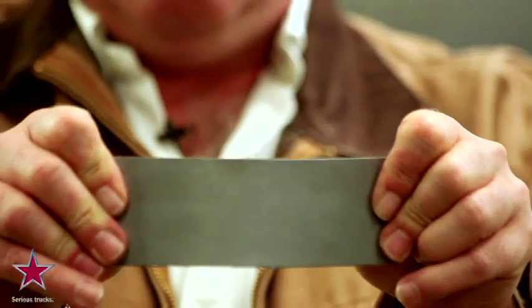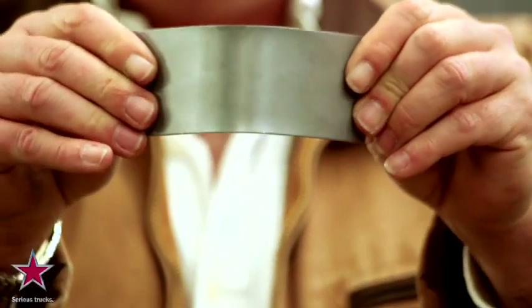With galvanizing, the steel is dipped in the 100% pure zinc, then it's attacked by air knives to get the excess off, and then it's baked at 1,000 degrees. What occurs at that baking or annealing process is that the layer of zinc actually bonds into the steel. So you have a coating of 10% steel and 90% zinc. Now that you've got the metal transfer, you've got excellent paintability, you've got excellent spot weldability, and you can stamp it, and you can bend it, and it doesn't flake off.